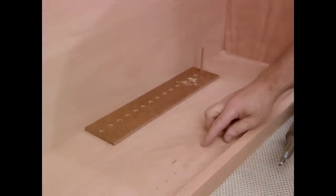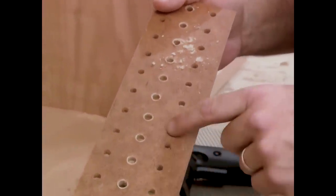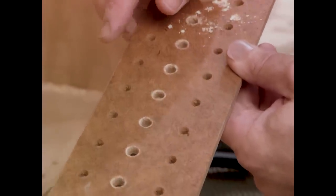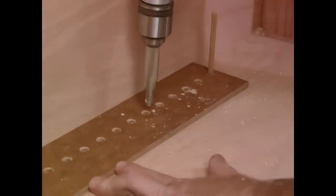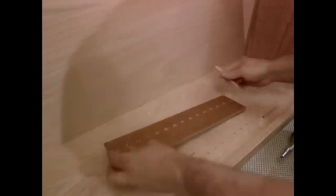Now there's any number of ways to drill the holes for those little clips, but this is a tip that I picked up from our friends at Woodsmith Magazine. Just take a piece of ordinary pegboard — it has holes that are uniformly spaced about an inch apart. I've set mine up so that I can drill holes either an inch and a half from the edge or two inches from the edge. I took a Forstner bit and made a slight recess at each hole so that my drilling device would fit into it. This is known as a Vix bit. The silver part is a centering device; the black part is the drill bit. After drilling the first hole, I put in a dowel, slip the jig on, and just continue up the line. If you have a long run of holes, all you have to do is reposition the dowel, drop the jig back on, and just continue.